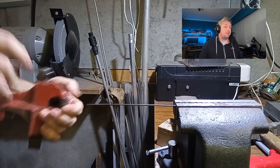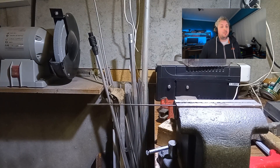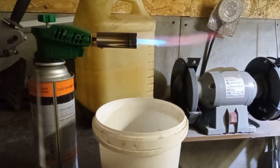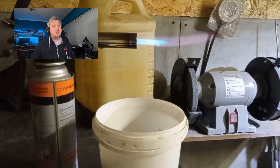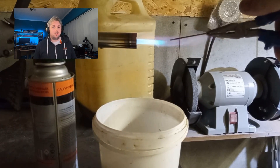The connections between the grains are typically what fail when we work with metal — we stretch and form these grains. The next step is to heat the wire. This links back to that grain structure; heating the metal hot enough allows it to recreate some of those grains.